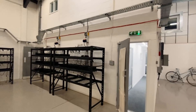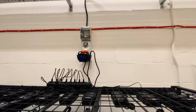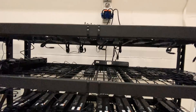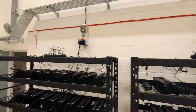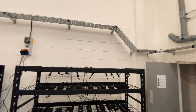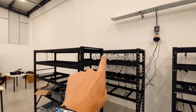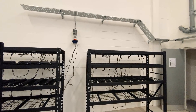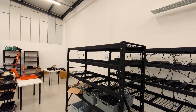This is what we've done for the three phase sockets - we've done this cable tray all the way around. We've done three phase 16 amp sockets and they've got these European plugs that split off the three phases and then come down into these splitters, which then come down into the chargers, which are going to be charging all of these batteries. It's quite a hefty setup. We've got three 16 amp circuits and we've put a big hefty cable tray in for future proofing, as there's another seven sockets they want installing, continuing all the way around for another seven charging bays. But there's not enough capacity at the current distribution board, so this is a sort of initial setup to get them going, and we're going to be adding a lot more later.